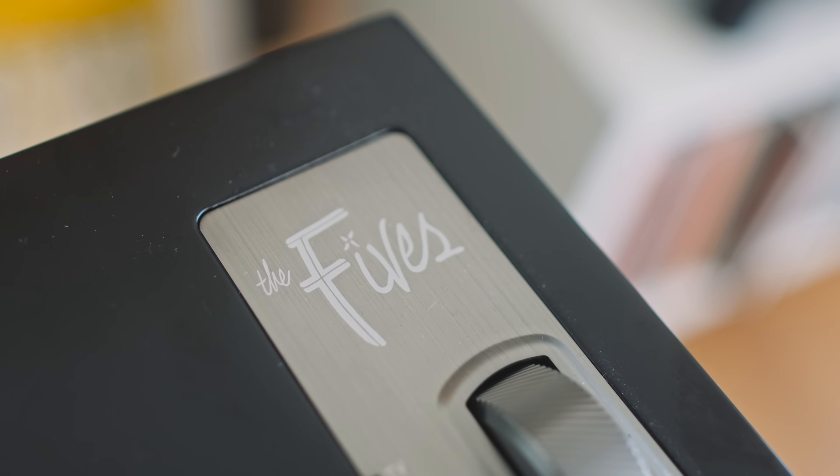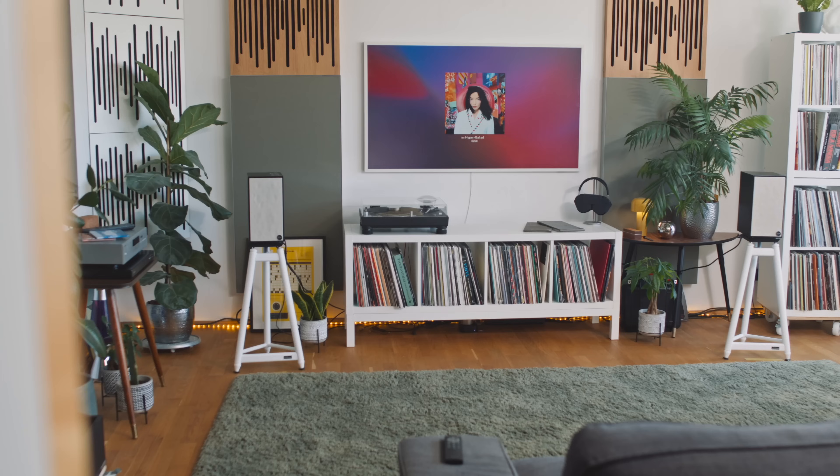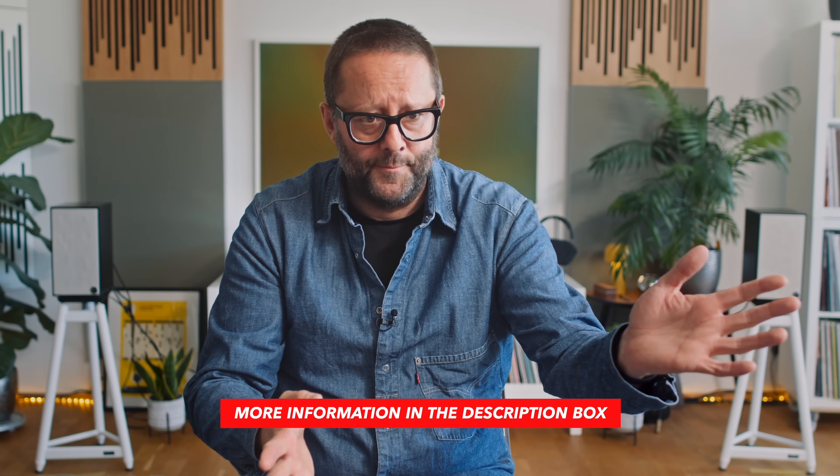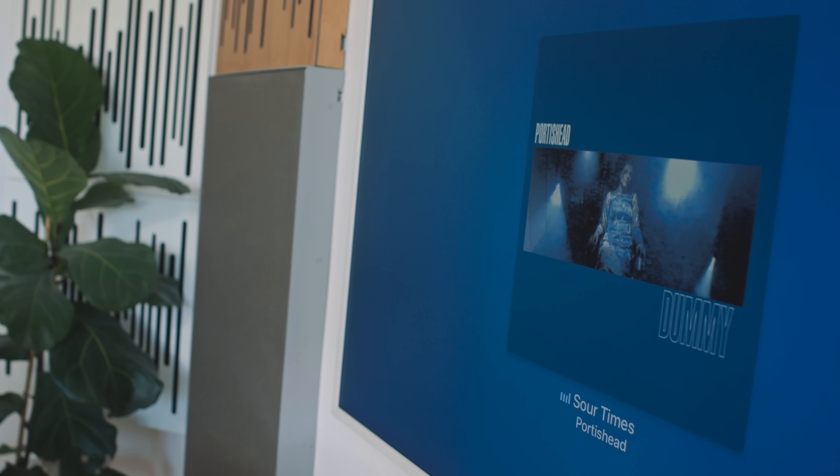The Fives were first released at the very start of 2020. What Klipsch tried to do was load in something called dynamic bass — basically the lower you go with the volume, the more they compensate in the low end and give it a push. Essentially Fletcher-Munson curve correction, because our hearing is non-linear: as volume goes down, our hearing becomes less sensitive to the top and bottom end. They also had something called flat bass, available by doing some kind of weird dance with the remote control. But even with flat bass, the bass from these loudspeakers was bloated and congested. So at the end of 2020 Klipsch released a firmware update introducing a third setting called bass cut, which apparently was actually a flat frequency response, and people liked the sound of that a bit more.